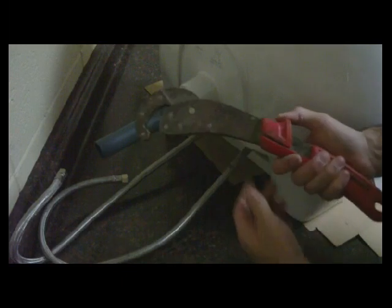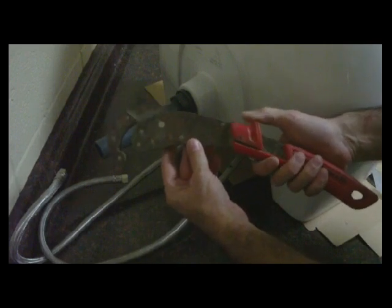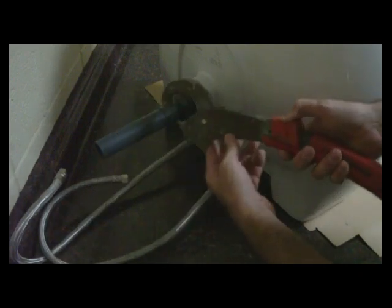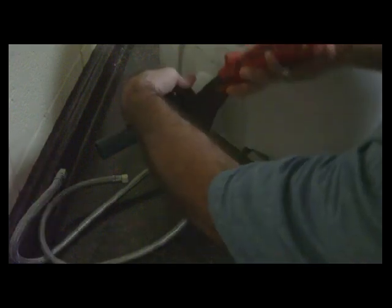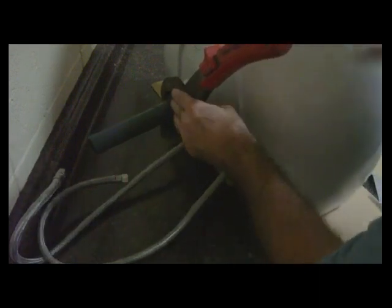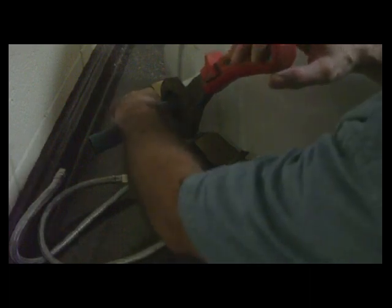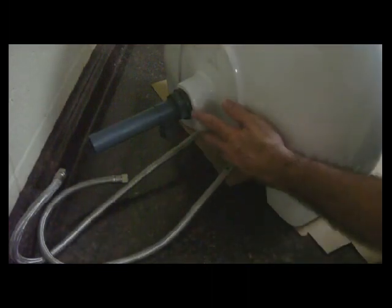Once this is hand-tightened, I'm going to go around just one time. This is a pipe wrench — open it up with both hands, hold this particular spot down. You want the opening to the back, so I'm going to hold that as a brace and just tighten this up a little bit, go around a couple of times. You don't want to do too much force — all I'm trying to do is get the washer all the way up so it's a good connection right here.